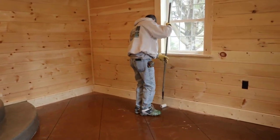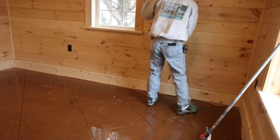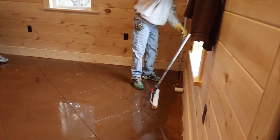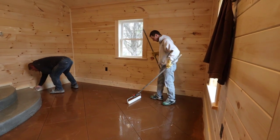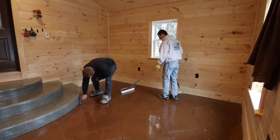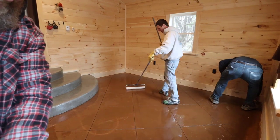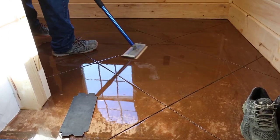You can see where I laid out the epoxy in ribbons — it kind of soaked into the concrete first, leaving those ribbon lines, but those all go away as the floor starts absorbing the epoxy. Luke got it all squeegeed around, and I'm going around doing the edges with the roller — he's going to come behind me with a brush to cut those edges in and make sure they're perfect. Then once I get done with the little roller I'll use the 18-inch roller, rolling it back and forth, then do one complete back roll from one side to the other. Working with epoxy there's a little learning curve — I teach that in my course down in the description.